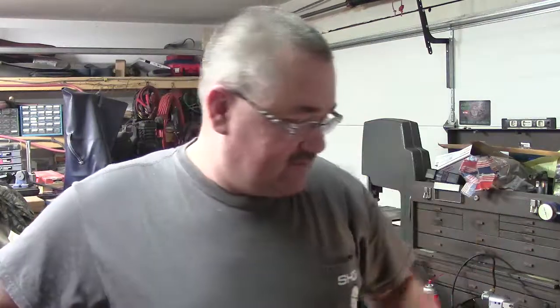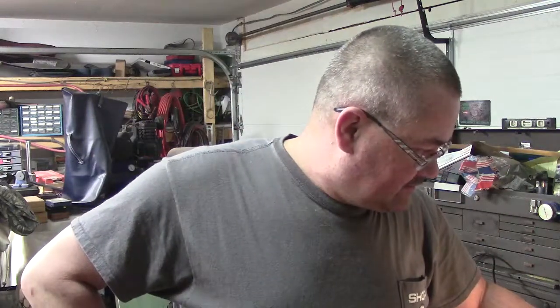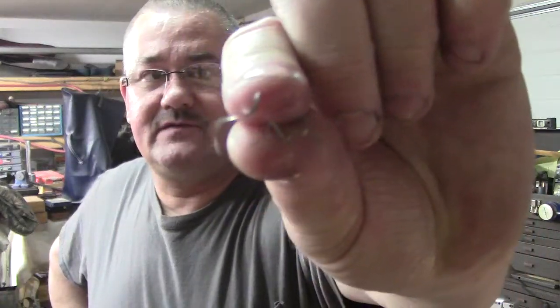The reason I went ahead and used this one that I did on the wood is because it had that little bit of a scoop, and I've shown you guys the little curls, almost like stuff that would come off a lathe. You can see the little curly cues, okay? That's why I chose to use this one, because it already had that positive rake to it.